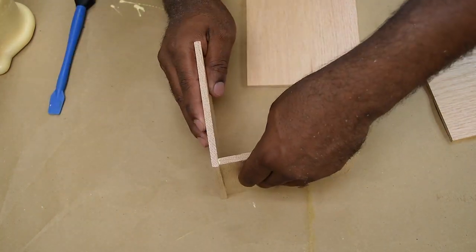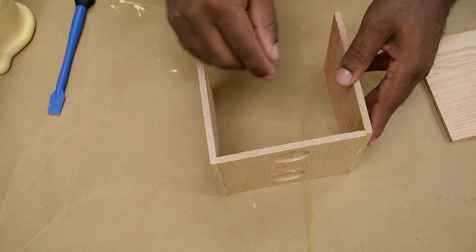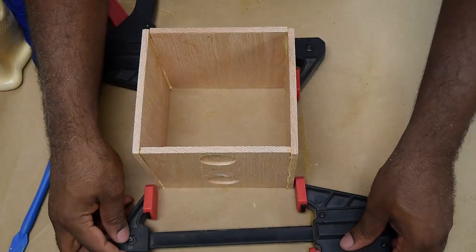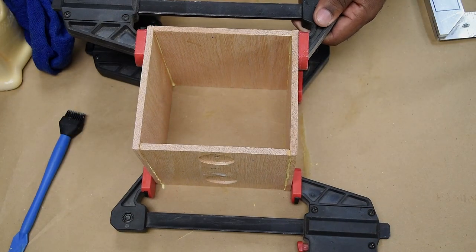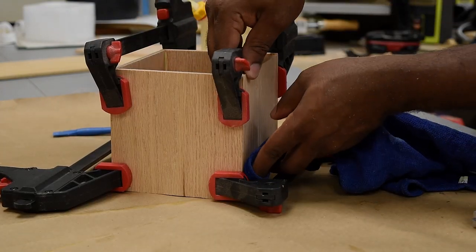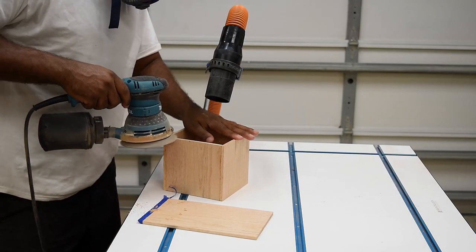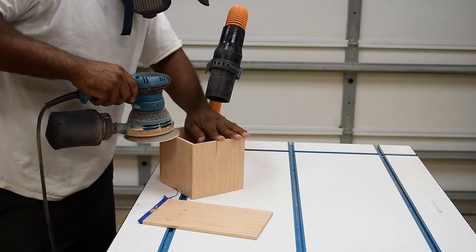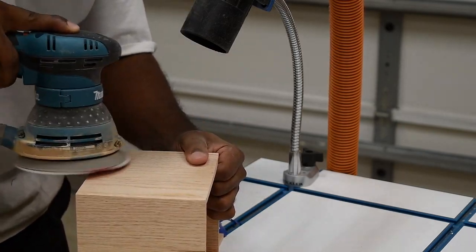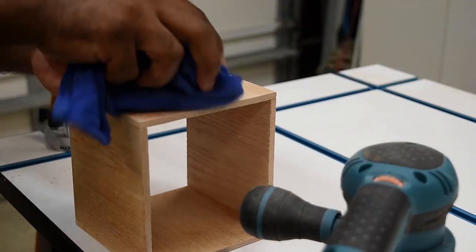I thought about mitering the box, but since this is solid oak and not layered plywood, by the time you put it all together the line will virtually disappear. The stickiness of the glue should hold the box together long enough to get your clamps on. After clamping, check for squareness and remove all excess glue. Allow enough time for the glue to dry, then sand it down — use 120-grit to lightly sand the perimeter and end grains, then the joint areas. After the first pass, come back with 220-grit, then wipe with a wet rag so the grain stands up, and sand once more.